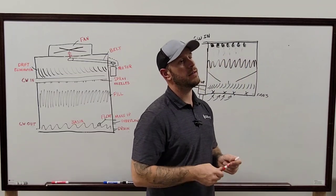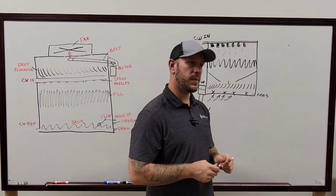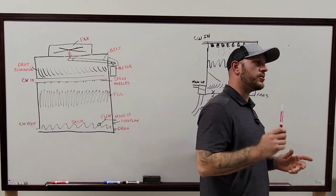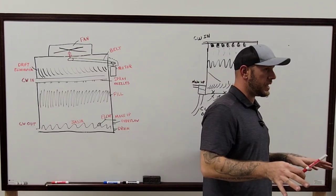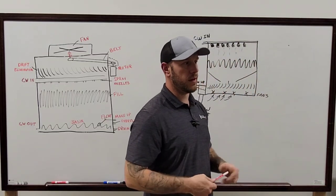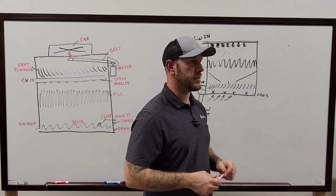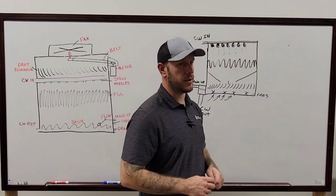Yes. That's why those slinger blades that they come with, don't put them on the top. They go on the bottom to keep moisture from getting in there. You put the cream grease in there so that if moisture gets in, it can push out the moisture without taking out the bearing. But once the moisture starts getting in there, it doesn't go anywhere. It just starts to rust everything on the inside, and then you're putting grease over a rusty ball bearing, which is just going to go out eventually.